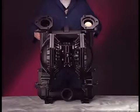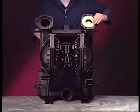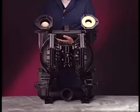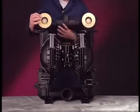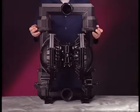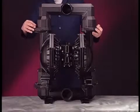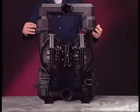Stand the pump upright. Install new ball checks into the upper outlet manifold. Place the seats in the upper outlet manifold, then place the manifold on the pump. Use the 16 mm socket to torque each to 60 to 70 foot-pounds or 81.4 to 94.9 Nm.